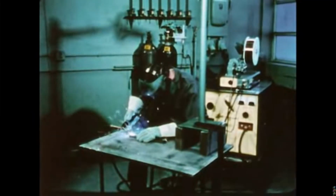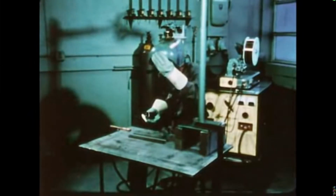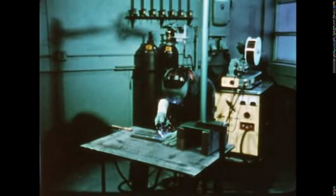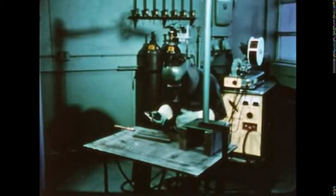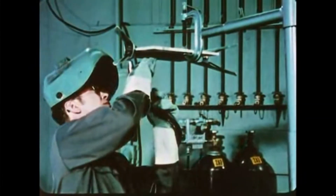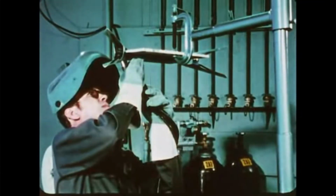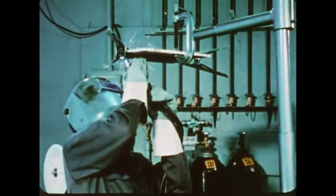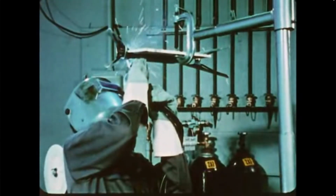Overhead prepared butt welds are made much the same as the vertical weld we made earlier. Tack your plates and clamp them in position. Position your torch for welding from right to left so that you will be able to see the weld puddle clearly and control it closely. For the root pass, use a slight back-stepping torch motion and bridge the gap completely.